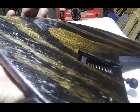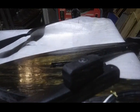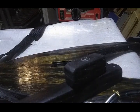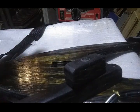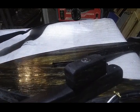That's all there was to it. It was sanded to 60 grit before I put the poly on. I just poured on one coat, basically, and had pretty much normal drying time. Wow, that's shine! And it hasn't been sanded, polished, waxed, or oiled — this is just the single coat as it stands. All I've done is brush off some dirt. No further processing whatsoever.